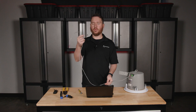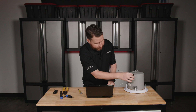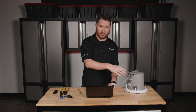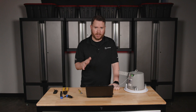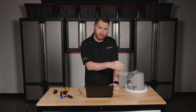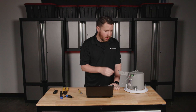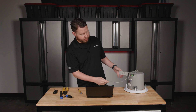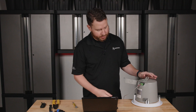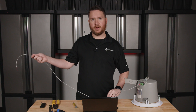The other end of the cable will go to my amplifier. When doing this EuroBlock connection, you want to double-check around the speaker and make sure there aren't any other notes you need to look at. Different speaker manufacturers have some different specialized notations — sometimes there's a 70-volt input, sometimes there's an 8-ohm input based on how it's wired up internally. The Atlas does not have that on this particular speaker, so basically we are good to go and wired up. If we need to wire to the next speaker, we can use that pass-through, or we just hook right up to our amplifier.